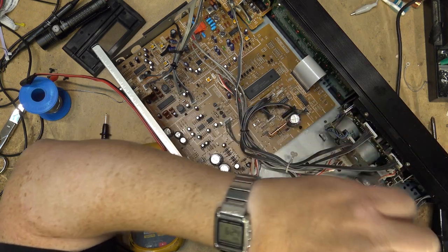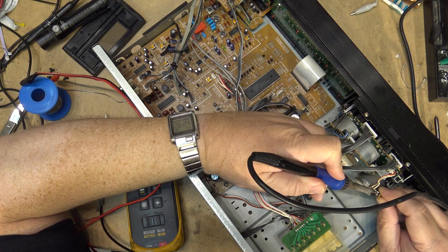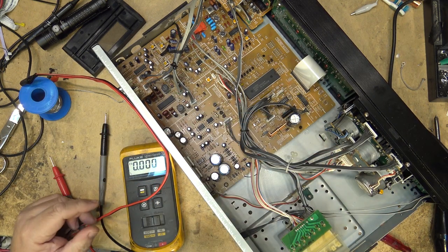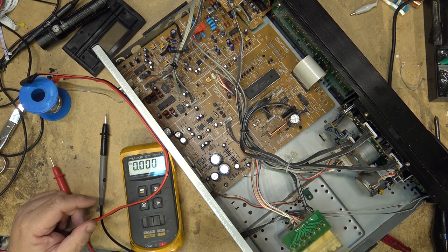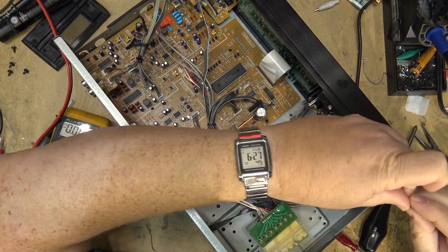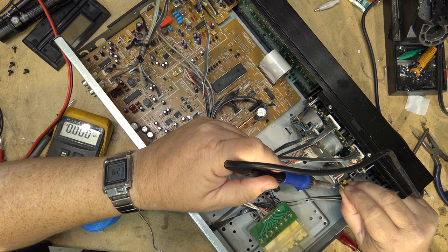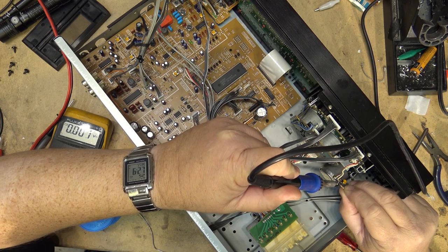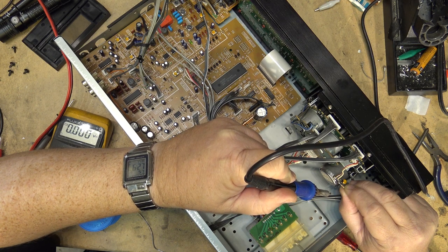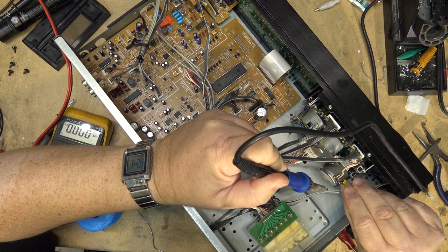The other one had a resistor in series, like on the other little circuit board, there was another resistor. So we'll just pop that open and I'll go and get the series resistor from the other motor board. So I'm going to put a 4.7K resistor, which should be in the ballpark with what I need. Mount that onto the B terminal. And then connect the other side of that back up to the control.